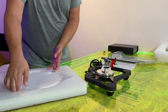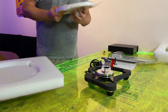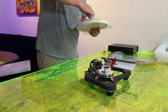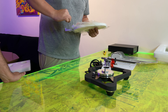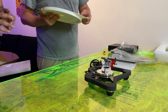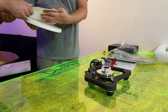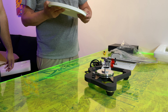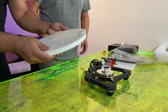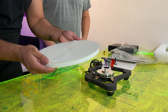The instructions are telling us: do not jostle the subplatter, because the subplatter actually has oil in it — that's where the bearing is. And the reason it's telling you not to touch the tonearm is because that's where your bearing pivot is. If you grab and pull up on the tonearm, you can potentially bind the bearing and cause problems. When you lift the P8 or the P10, you want to pick up from the frame itself.